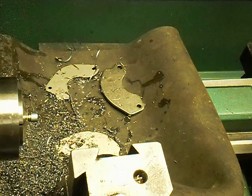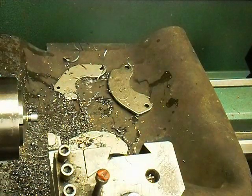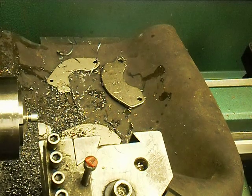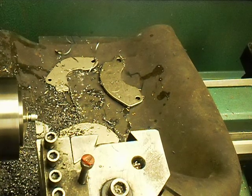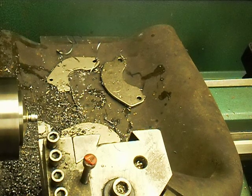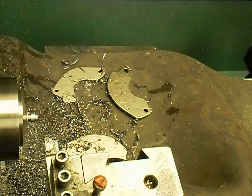The first thing I'm going to do is turn up the diameter on this side. I'll go in, set my zero for the length, and back out. This is the same diameter I turned on the other side — a 2.218 diameter and it's 63 thousandths long, so I can go to the same setting, leaving ten for a finish pass. And that's it for the turning.